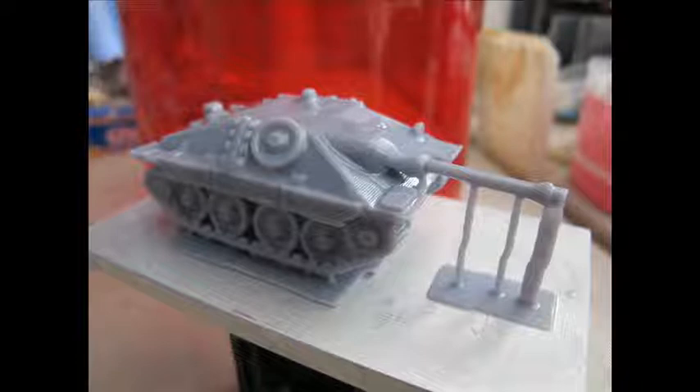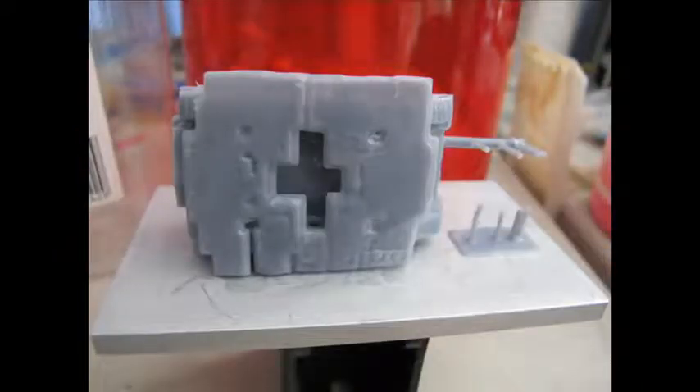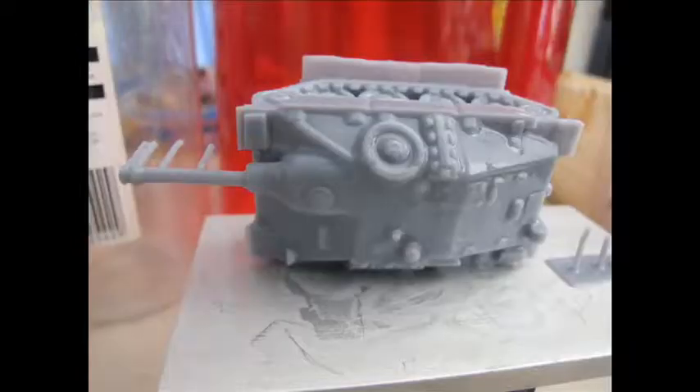Quite lovely. Straight out of the printer we noticed there is a bit of warpage around the supports that snapped off and ever so slightly an amount of lifting. I did not have an initially long exposure time on the first layer — later on I go with the recommendation of 90 to 120 seconds, with layers at only around 10 to 12 seconds. Normally I prefer around 20 seconds for other resins. Future prints do significantly improve. Other than that it's very smooth and the detail is fantastic.